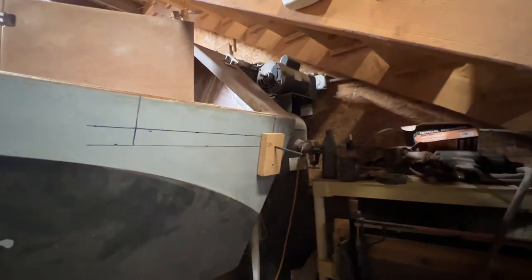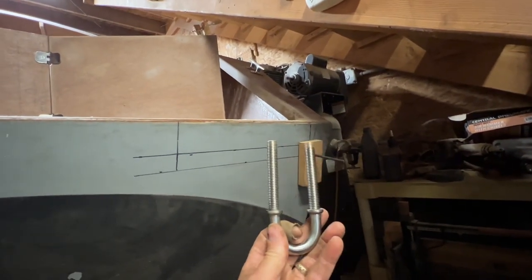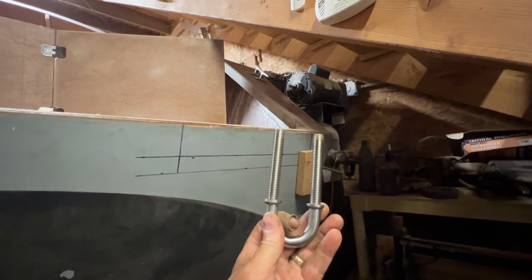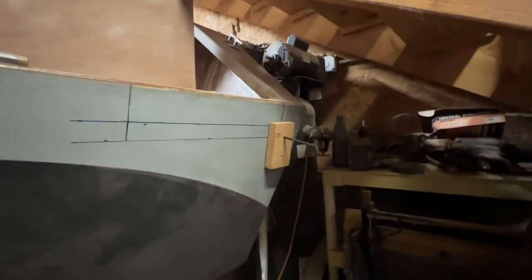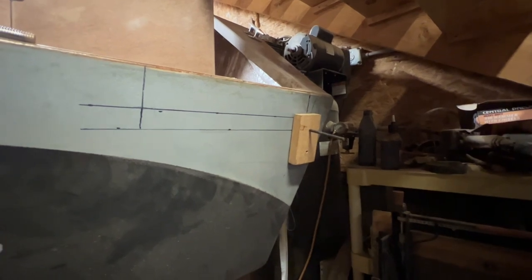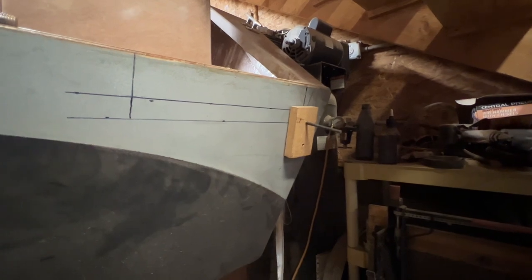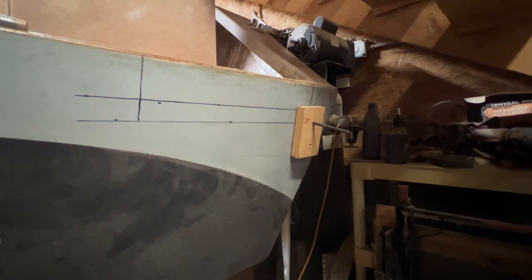I start with a small drill and will increase to a larger jig and larger diameter drill bit. This is half-inch but the drill bit I'm using is five-eighths, and that will give me good room to coat with thin epoxy and then thickened epoxy to make sure the edge grain is all sealed up. Once that's good and secure I'll run a dowel with sandpaper in there to smooth it out.